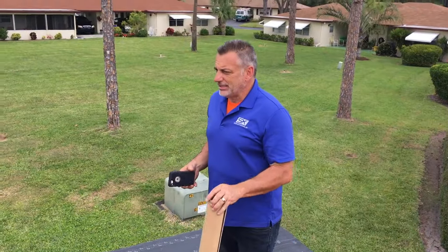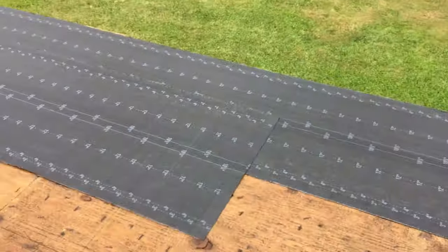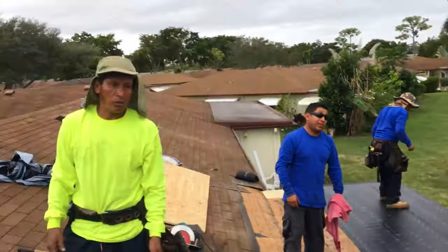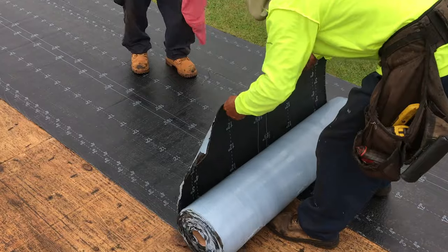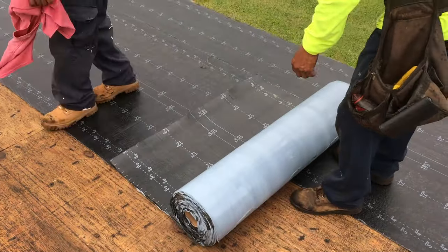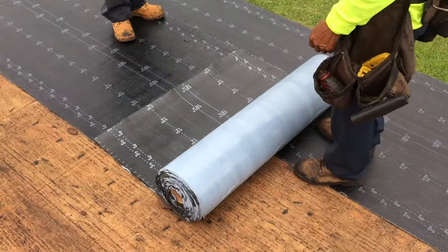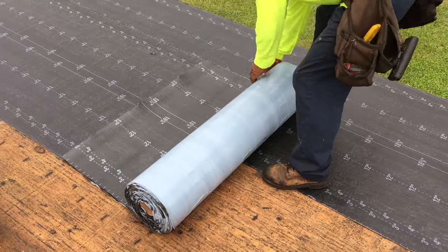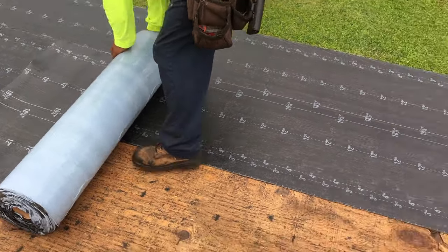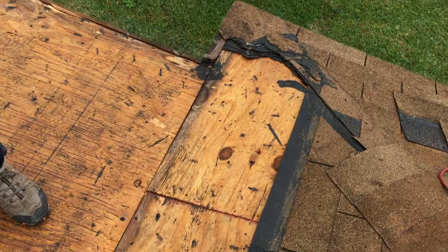Right, so, does it stop raining? Stop here. Put one more and we'll see if the inspector gets here. Does it stop raining? Stop. Yes. Just put one more. Flip it. Yeah, 4 squares of this stuff, so it's almost like 2.5 rolls. Okay, so you put an extra on. Because it's going to go up all the way to here. Yeah. And then we put these old shingles back on. Yes. He's bringing new ones, too. Oh, is he? All right. And that'll be a good enough barrier? Yeah, whenever the ones that are damaged, we'll throw them out and then put new ones in.